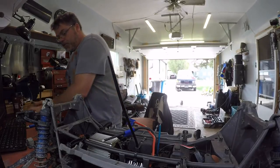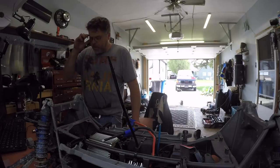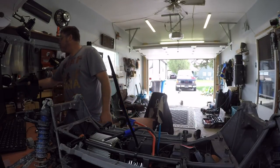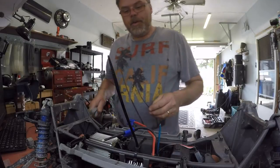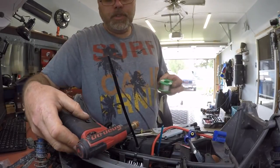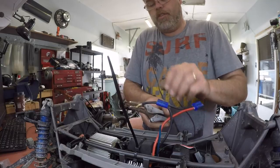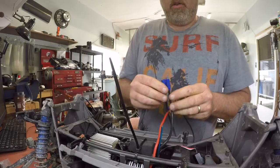So now we need two — where's number two? Where did I put it? How do I get so much crap on a bench in like five seconds? I know why — because I'm making a video and I don't care about cleanup, I just want to get her done. I rushed myself right out of a piece. Oh there it is — on the ground. We'll get the old torch fired back up, get the old solder, do the same thing — heat her up, give her a dab, stick that in there, and let her rip. There she is — now while it's hot, pull it into this part. Decent.